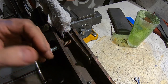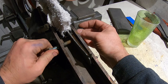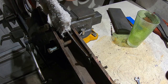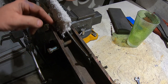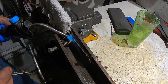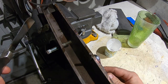It's probably only about a sixteenth of an inch, but I notice it. So I have this straightening jig which has two of these little guys — there's a slot here and these just move back and forth — and then I can tighten the bolt to apply pressure. Then I'm going to take a torch, point it at this, heat it up and apply some pressure. It should straighten it out. I have the blade wrapped in a wet cloth here just so there's no heat that travels up to the bolster or down the blade. As sometimes happens with these, I went a little too far and now it's bent the other way, so time to repeat.